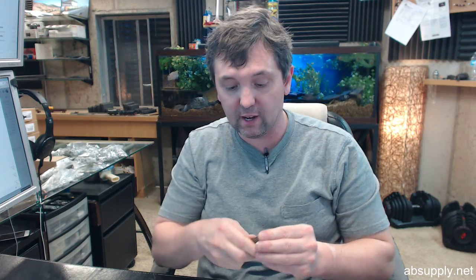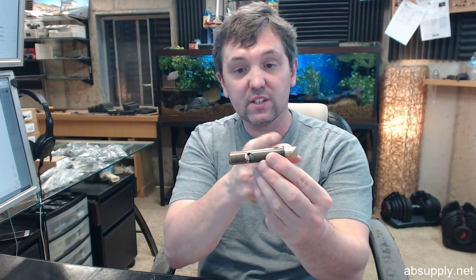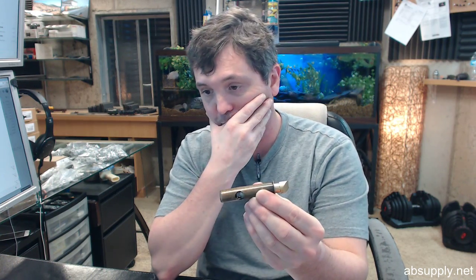1 3/4 back set. That means this. From the edge of the door, which is going to be here, to the center of this hole has to be 1 3/4. That is crucial because now obviously the length of this is dependent on that. Okay.